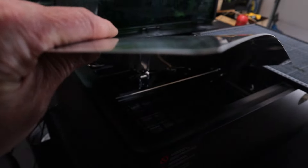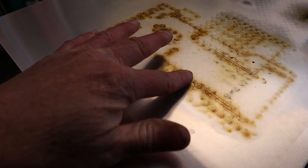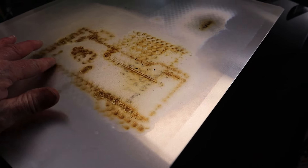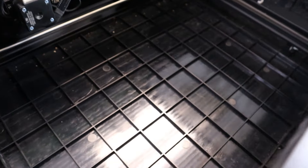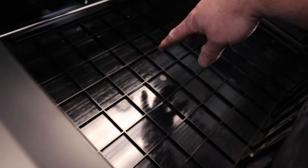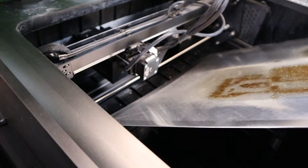There's a thin piece of steel at the bottom protecting it from the plastic case. It is a very thin piece of metal — at some point you could flip it over. You can already see some staining from all the cutting and engraving, and even the pattern of the honeycomb coming through. The bottom of the case is just pure plastic, so it would have been nicer to have a more permanent integration of metal into the bottom like I've seen in other lasers, but they're trying to keep costs down and this is the solution they've come up with.